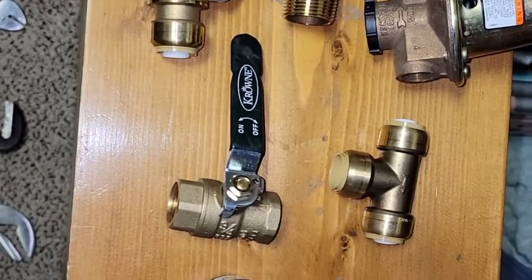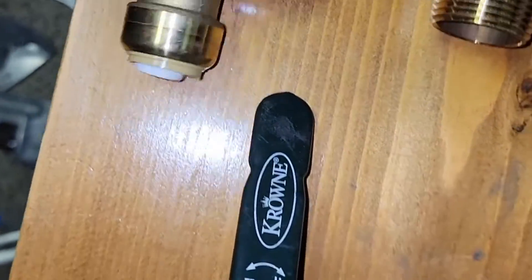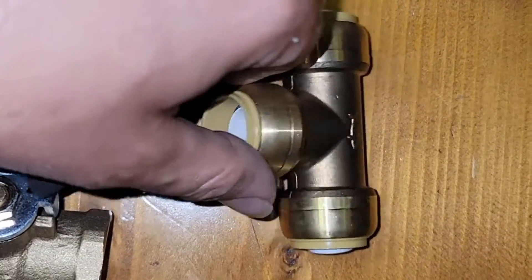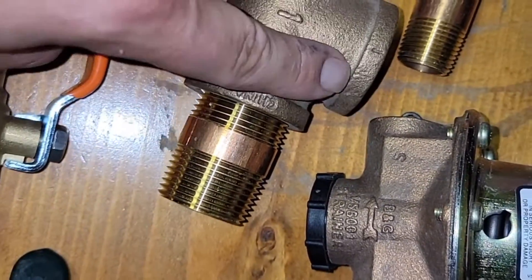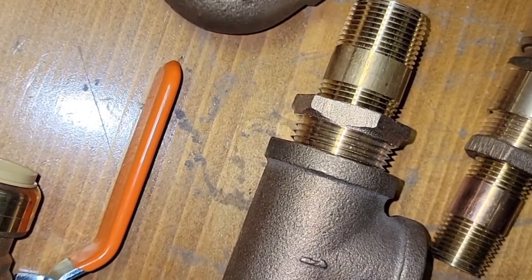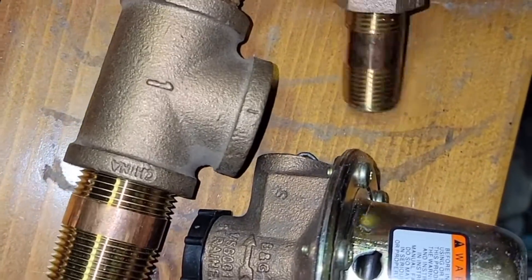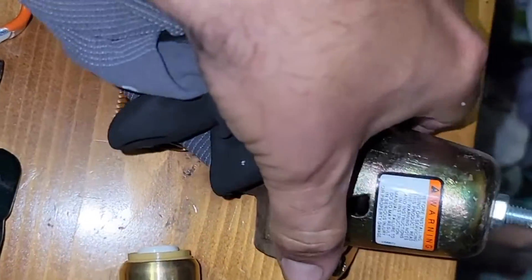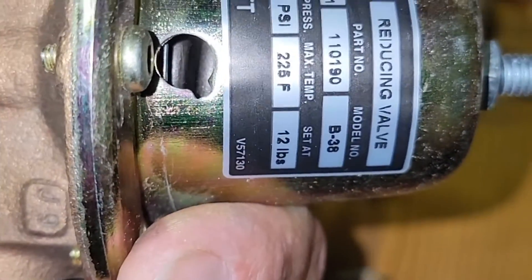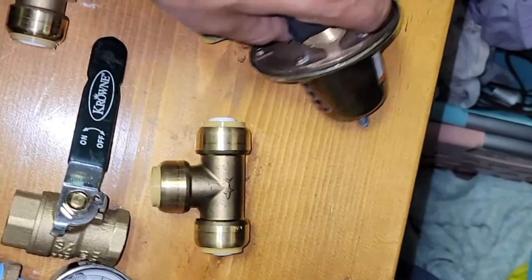Let me show you the components I'm using. I've got some three quarter inch PEX pipe, a water pressure gauge, a three quarter inch shutoff, a three quarter inch by three quarter inch SharkBite fitting, a three quarter inch by three quarter by three quarter T SharkBite, and some brass fittings. There's a 1 inch by 1 inch by 1 inch T, a reducer from 1 inch to 3/4 inch, a 90-degree fitting with a 3/4 to 1/2 inch reduction, and a 1/2 inch back to 3/4 inch reducer that goes to the PEX line. I've also got a pressure reducing valve — I'm going to maintain 12 PSI with this model. Whenever the system drops below 12 PSI it'll automatically repressurize.